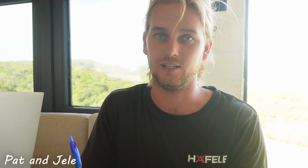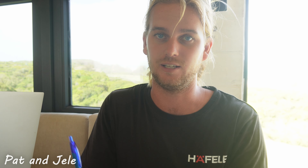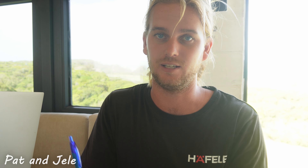Think of a blender that uses 250 watts — use it for an hour and it uses 0.25 kilowatt hours, which is then easy to calculate as a percentage of your total battery capacity, instead of having to convert back to see how many amps the device uses. If you have any questions, leave us a comment below or send us an email. Now let's go into a bit of the more technical stuff — why go with a 12 volt, 24 volt, or 48 volt system?